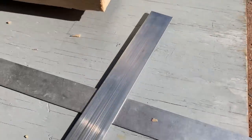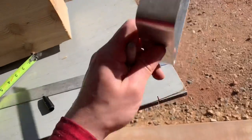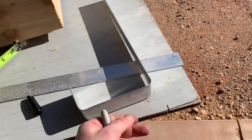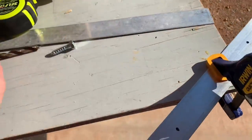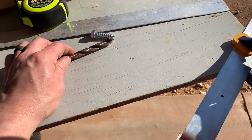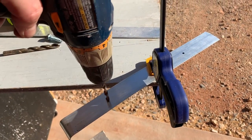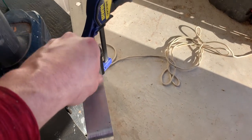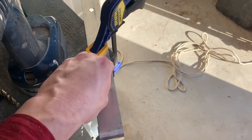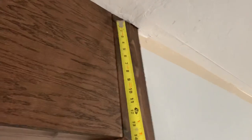I want the lag bolt positioned about a third of the way down, matching the spacing of the other lag bolts. I pre-drilled that hole, then pre-drilled one right smack in the middle of the back for one lag bolt there too — it just adds character, a little wow factor, a little conversation piece. Then I drill a pilot hole first — start smaller and go bigger — and torque the lag bolt in with a wrench set.